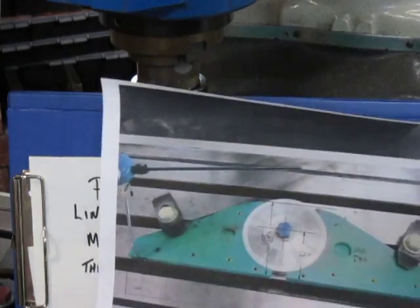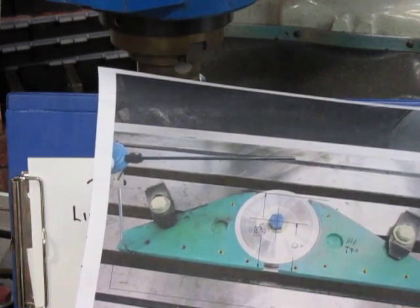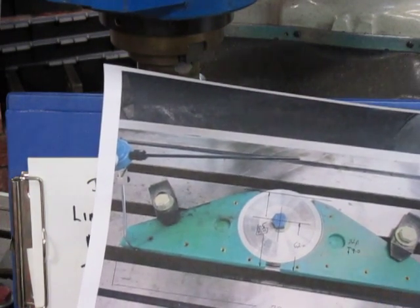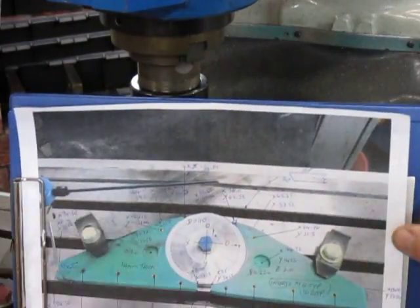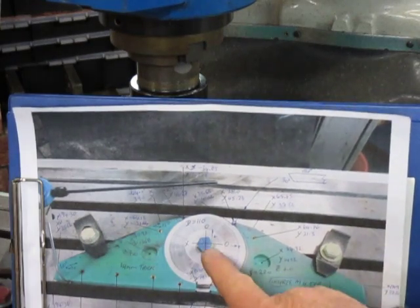What I've set up is to make two at a time — they're right and left hand sides, and I've got four to make altogether. That's what they look like when set up on this mill to take measurements. I did a pickup of all the dimensions of each section doing an XY.